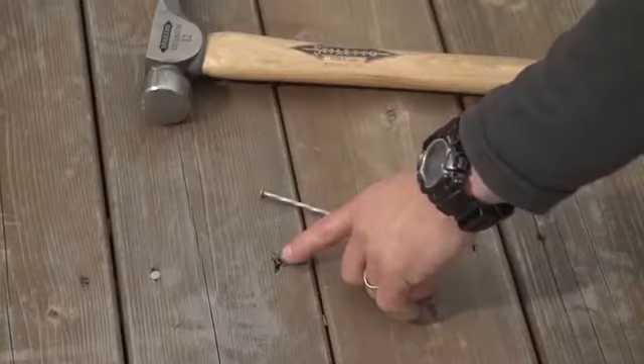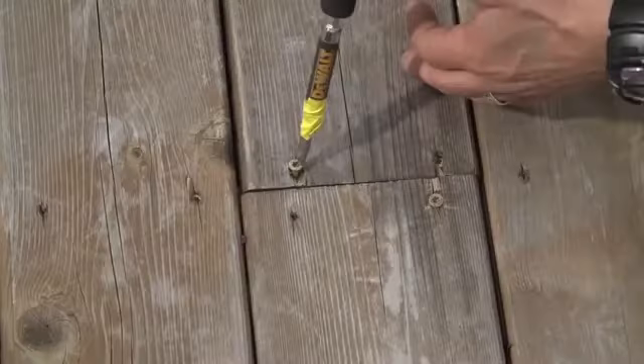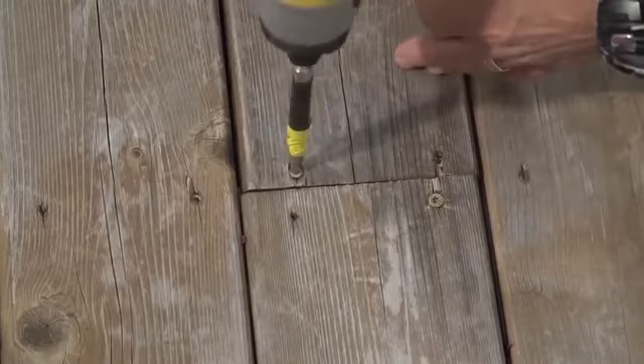It prolongs the life and the safety of your deck. Check nails, screws, and anchors and tighten them where necessary. If a fastener appears fully rusted over or severely corroded, replace it — a corroded fastener can cause deterioration in the surrounding wood.